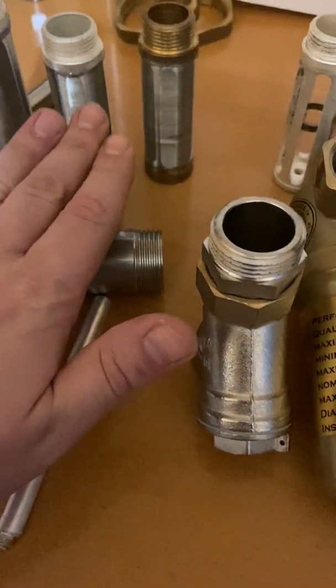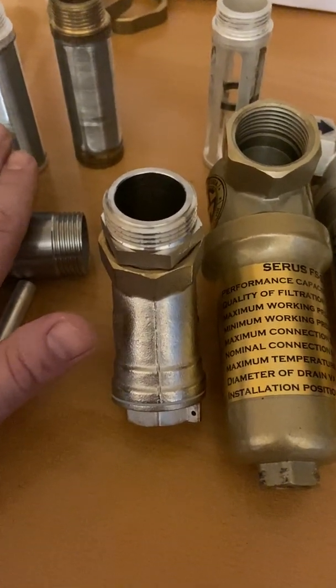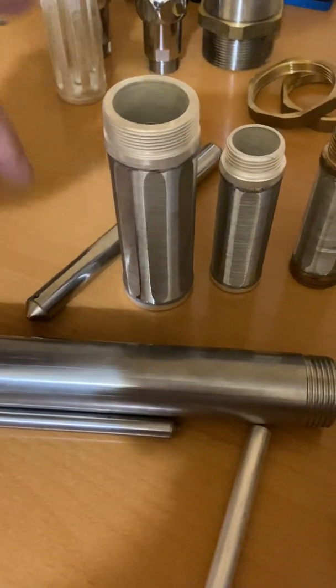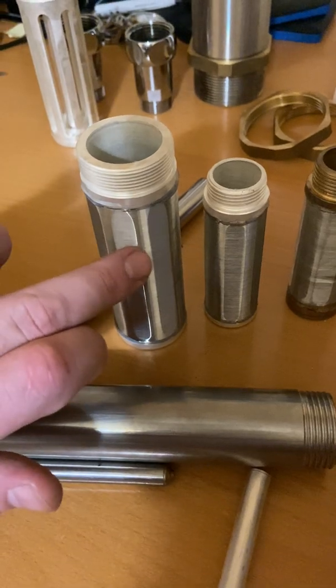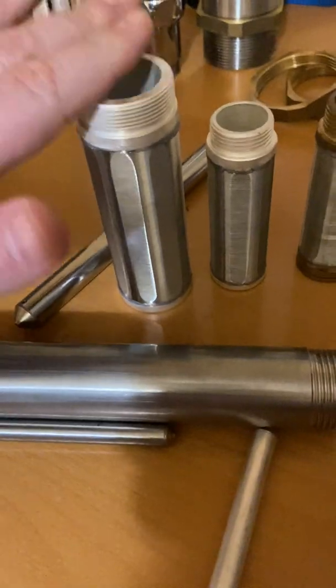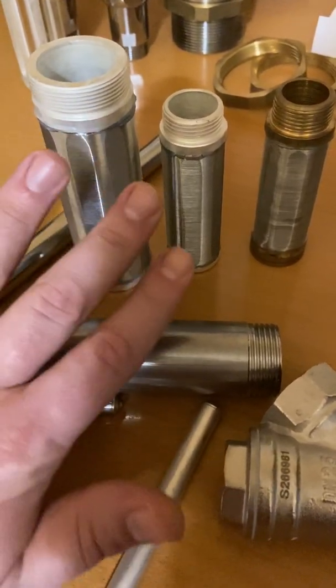This is basically a spiral microwire, and under vibration the filter element drops the dirt. Unlike usual filters that intake dirt into the cartridge and require cartridge replacement, here it's reversed — water goes in, swirls around, and only what is less than one micron can penetrate the microwires, which are thinner than a human hair. Everything else has a mirror effect — it just stays on the surface waiting to be flushed. Every three to four months you open the bottom of the filter housing and do a gentle cleaning of the membrane, because heavy metals and similar particles won't pass through the cartridge so it will start getting yellowish.